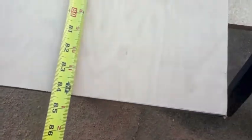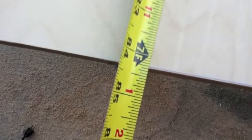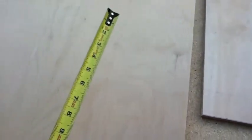But here's the best part. When I measured the first one, I measured out to 7 feet 1/4 inch. That's where I was going to cut it with my little handheld jigsaw, which would give me 1/4 inch to come back in and fix it with my router. I measured from the line out to the router fence that I made out of that aluminum track, forgetting about the 1/4 inch in my world, assuming it's 7 feet, 1/4 inch, and of course it came out to be basically 2 inches and a 1/16. So I came to the second board, measured up 7 feet, put my line right there where my ink is, measured back 2 inches and 1/16, clamped it down, and got that pretty line nice and true and straight.